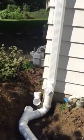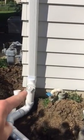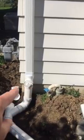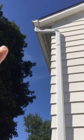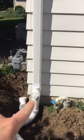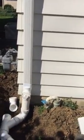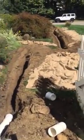Going back around out here putting clean outs in so that they can clean their own downspouts. Stick a hose in there and run water through this to clean out the line on their own in case they get leaves in the gutter from the tree. You can see they come down — they usually get caught in the line. But now the homeowner themselves are able to clean that out and spray the line out with their own hose moving forward.